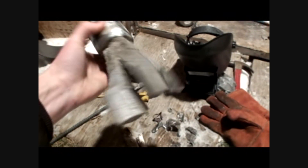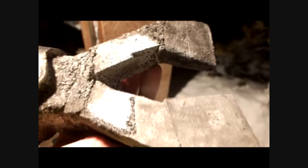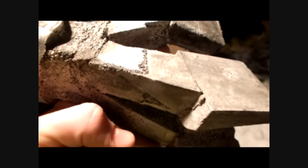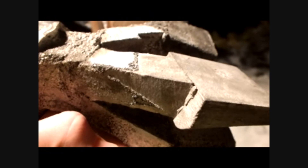My very first lost foam casting. Looking this over more closely, you can even see the line where it goes from plaster down here to bare foam right there — you can see the line where it's a better finish. You can also see the aluminum expanded out a little bit as the foam melted because it pushed the sand. So with the plaster you get more dimensional accuracy.